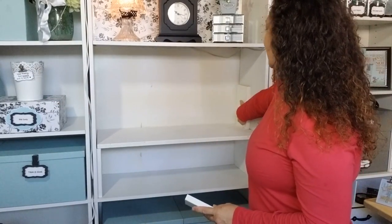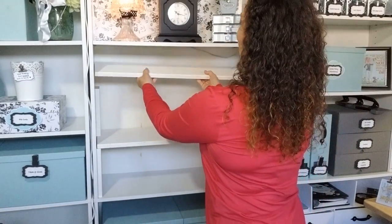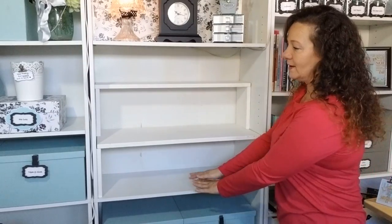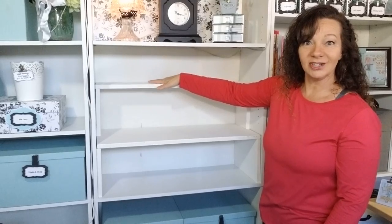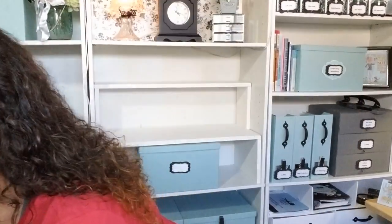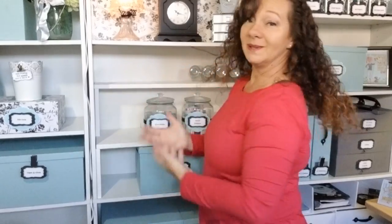The second shelf I did is a mini shelf, for pantries or cabinets where you have overhead space but can't reach things. Same concept, except this time I used a five-and-a-half-inch wide board that was eight feet long. I stand up those supports on the side right against the end, go on the other side, and place the 28-and-a-quarter piece on top. Just that quick! I now have the original shelf, and in those two or three minutes I was able to get a nice sturdy shelf plus an additional shelf on top. If you have canned goods, you can put things behind and still get access, with the shorter items on top for easy access.